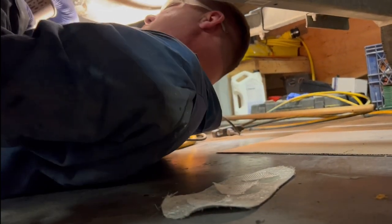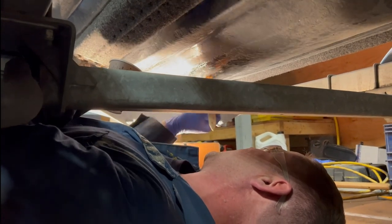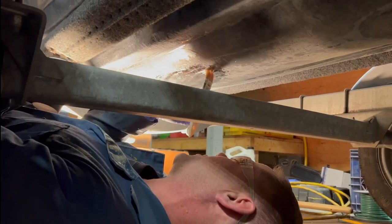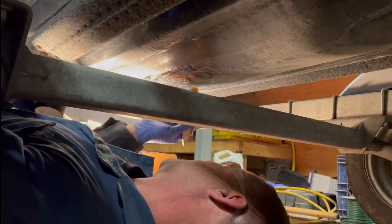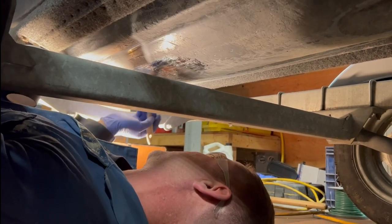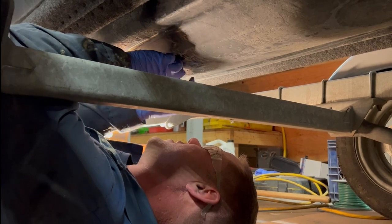With biax, you want to start a little wetter than you would otherwise. The nice thing is you can be a bit sloppy with your colloidal silica — when you wet it out, it sits down and lies flat. You just don't want it so wet that it floats the glass; you want it to lie down and soak forward through the glass. Especially with biax, because biax is going to be a pain to wet out. You'll get guys on the internet telling you that you can't use biax or chop strand with epoxy — you can't use chop strand with epoxy, but you can use biax, because biax doesn't have starch in it.